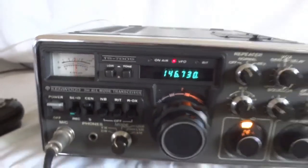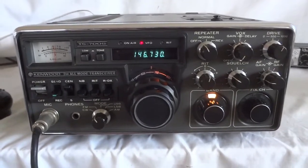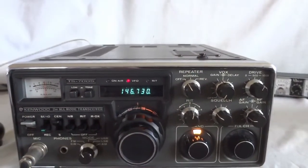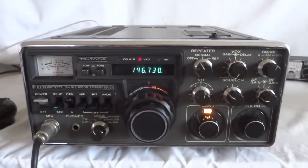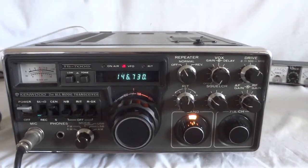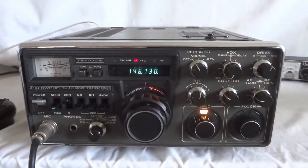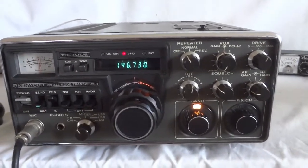Obviously radios nowadays don't have that anymore. That is of course because they're all synthesized and accurate enough. But it's also because this radio still has one of those good old ratio detectors in the FM detector, where it is very easy to add the discriminator meter. And these digital radios, well, they're not digital, but the highly integrated radios don't have that available anymore. They use quadrature demodulators, and it's harder to make that feature, so they just don't do it anymore. But that's frequency modulation for you.